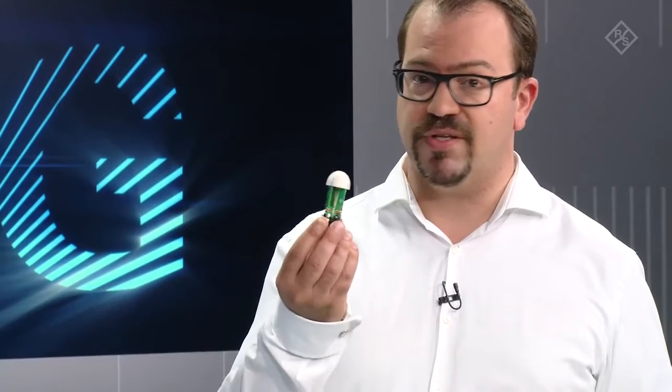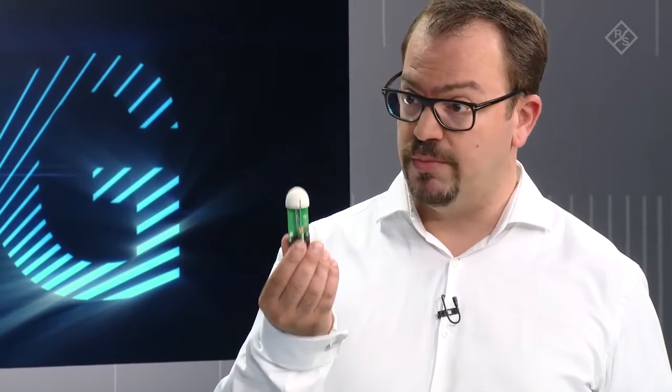With these positioning systems we are moving antennas. This is one antenna we use in our millimeter wave testing systems. In other systems I typically see horn antennas being used to create directivity, but this is obviously not a horn antenna. It's a dual polarized Vivaldi antenna — actually made of two Vivaldi antennas. A big advantage is it's broadband, covering the whole 5G millimeter wave range from 12 to 90 GHz with directivity higher than 10 dBi and cross-polarization rejection of more than 20 dB.